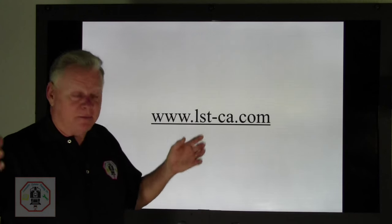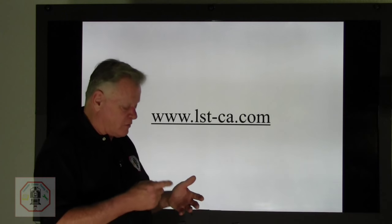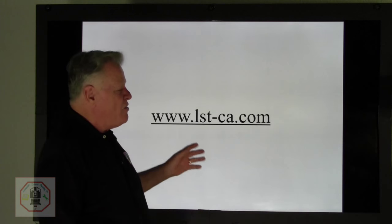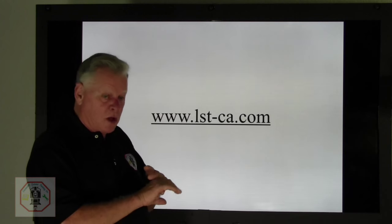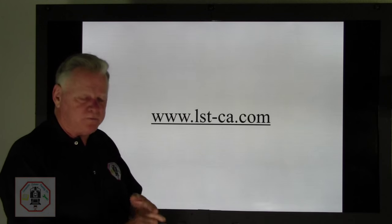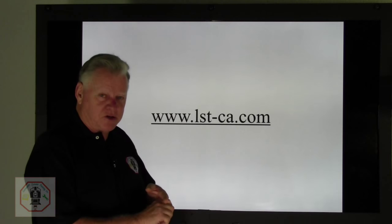Oh, that's it. So last video, we talked about the main reservoir circuit a little bit, then we discussed the equalizing reservoir circuit. This one, we delved a little bit further. We took the equalizing reservoir circuit and expanded what its job is to do, and that is to create brake pipe, not only to create brake pipe, but also to control it. When we make a reduction of equalizing, we make a reduction of brake pipe.